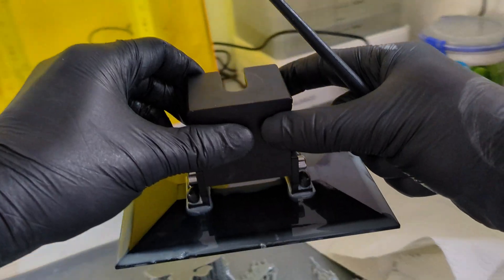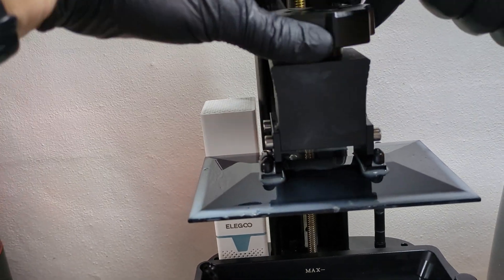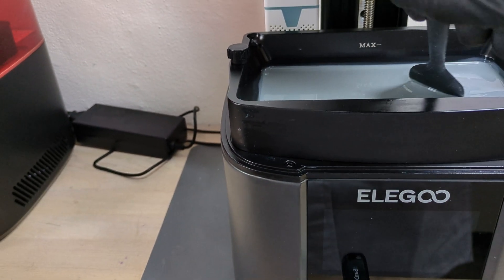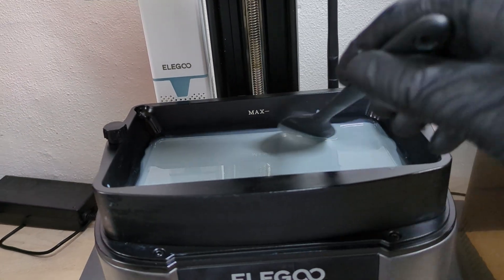I angle the build plate as it would be in the printer, take it over, and put it in — attaching it firmly and making sure it's ready to go. While I am there, I also check the vat with my silicone spatula for any debris or defects. If I saw any kind of fails or defects when removing the models, I will be extremely diligent in this step. I'm trying to make sure the printer is truly ready to print the next time I need it, because if I don't do it now I might forget and ruin the next print or break my screen.